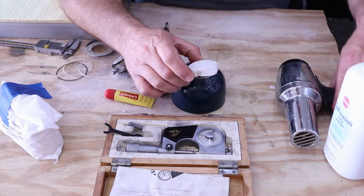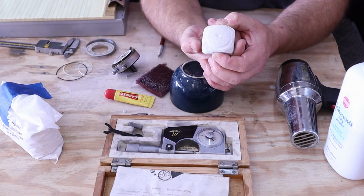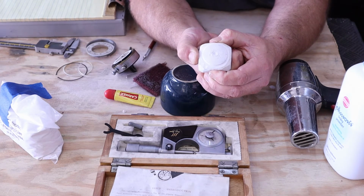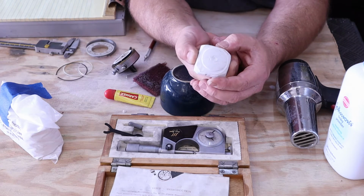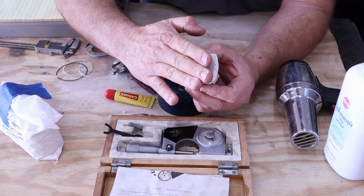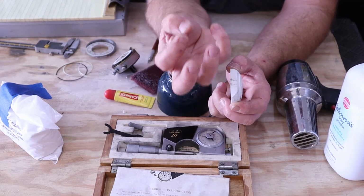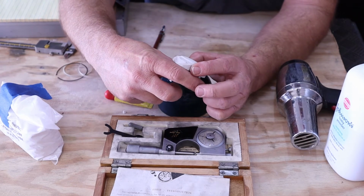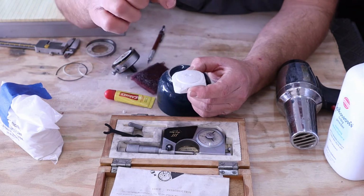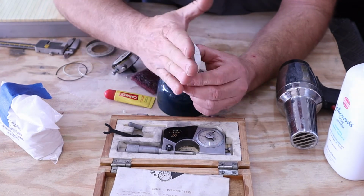The first one is that on my plaster of Paris mold, I had to put this in my 3-jaw chuck, or 4-jaw, so when I grabbed it, I wasn't able to grab it as hard as I would like to. I was afraid that the plaster would just split. So in thinking about this, the next time when I have to do another one, I'll probably start with a steel block that's roughed out on the top, just probably grooved, so that the plaster will adhere to it. So I have a block behind it that I can use to position in the chuck, and then create another box around it, pour the plaster in, get my indention set, and then carry on from there where the plaster is affixed to the steel backing.